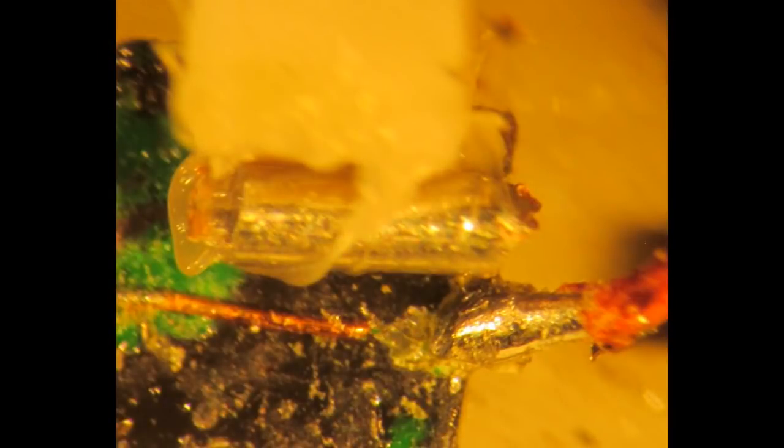In this photograph, you're actually looking at the whole oscillator. On the left, you can see this small hair-like wire. Again, that's our trimmer stub. On the right, you can see a small piece of magnet wire soldered to one of the leads of the transistor. And above those two, you can see what looks like a piece of white blob with another short piece of wire attached to it. And that's really what that is, it's just a very small piece of wire, and it's been epoxied to the end of a plastic shaft that goes back to the stage.